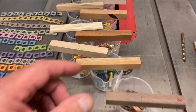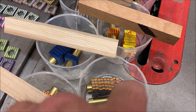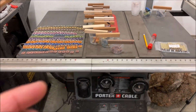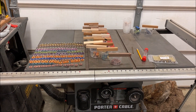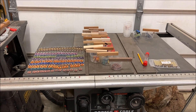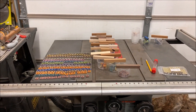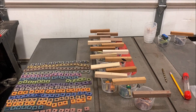I also need to measure the distance on the tube — you can see like that tube there. I need to measure how much to cut off the blank because I don't want to waste blank if I don't have to. I was leaving a quarter of an inch on either end of the blank when I finished these, and I don't want that much. It's just too much waste, and it becomes difficult to put the tube in and center it. So I want to get a little tighter on the ends.